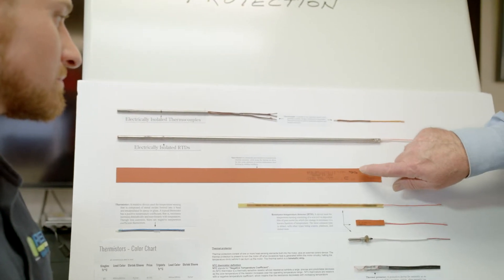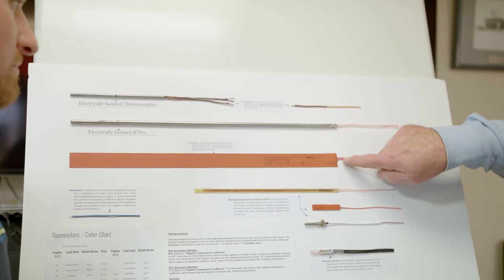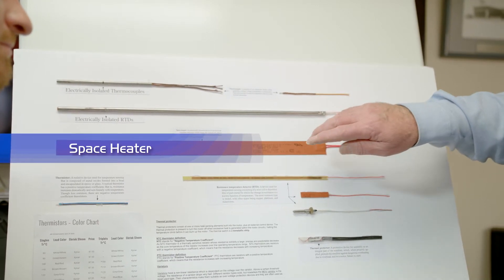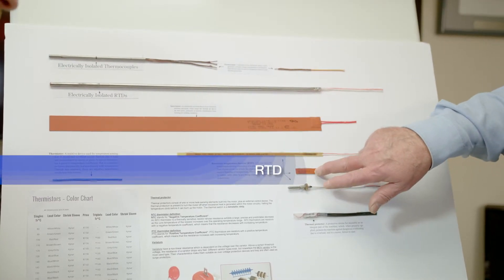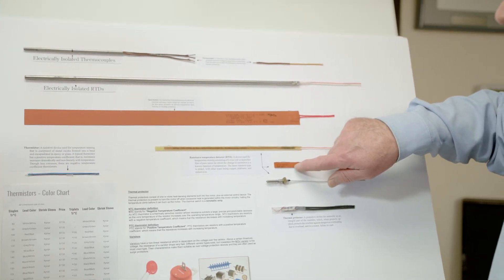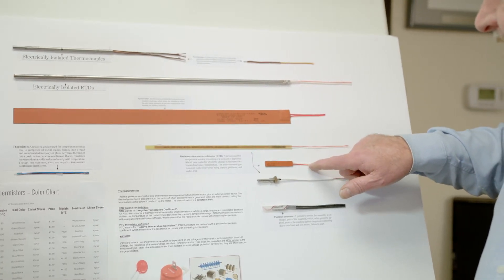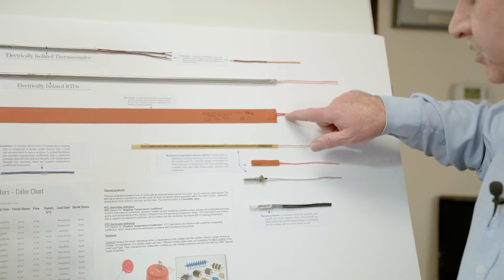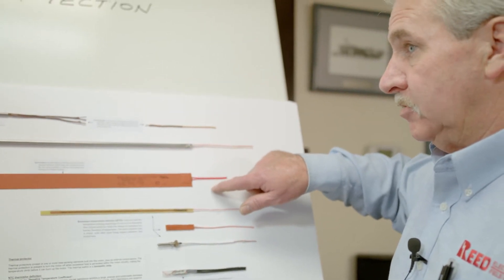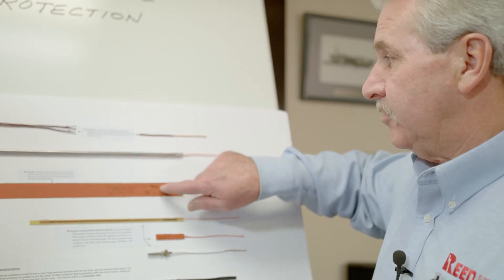So it's actually like calibrating. Going back to the space heaters — this looks identical to the RTD. We energize the space heater with voltage and it gets hot; it has nothing to do with the RTD. I put this up here just so you'd see that they look alike but are not the same. With RTDs you can see there are three wires here versus only two wires on the space heater. There are some two-wire RTDs, so you may see a white and red together, and it is most likely an RTD — but the space heater here is for illustration purposes only.